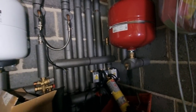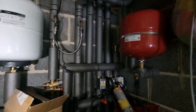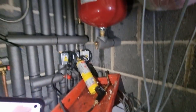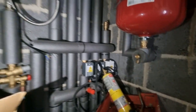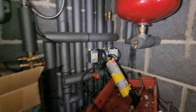I've just got that one sweated back up at the top — take two. We've got all the hot and cold filled up, and we're just filling the heating up now. We're in a really dark corner — the electricians are doing the fuse board so we've got no lights or power. Hopefully we'll pressurize up to about one to one and a half bar, then we're going to make sure we've got no leaks. Everything in the house was pressure tested — it was just this stuff that wasn't.